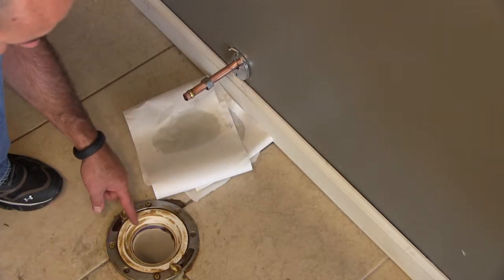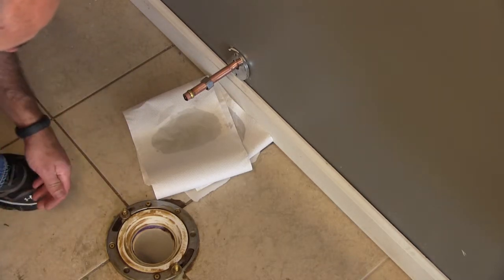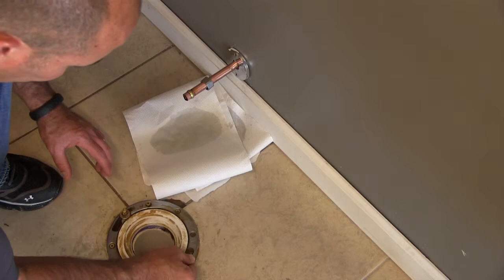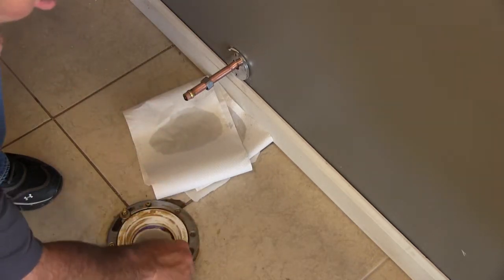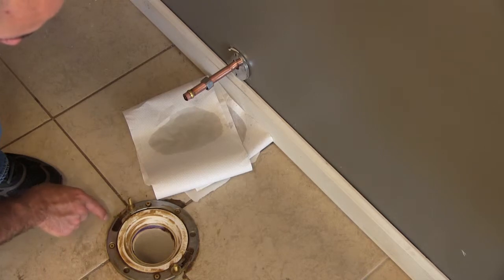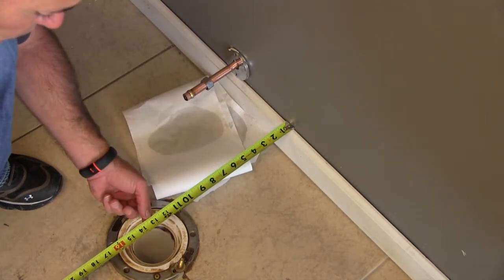I want to make sure my bolts will be securely snug inside the flange and will not pull out. If my orientation of the flange is wrong, the bolts could easily pull out and my toilet will never be secure. There's a little flared side to these fastening bolts for the toilet. When the flange is fully secure to the floor, I want to make sure the bolts will not pull out easily. You can see there's a wide portion to the flange where you can fit the nuts in, and then there's a skinny portion — I want those bolts fully seated in the skinny portion, 13 inches to the center of the flange.